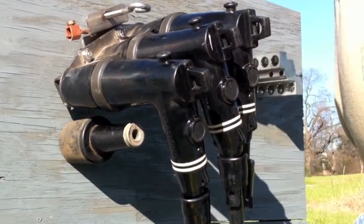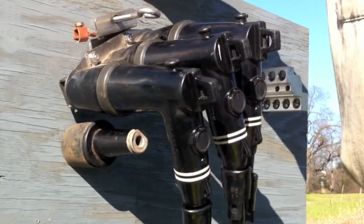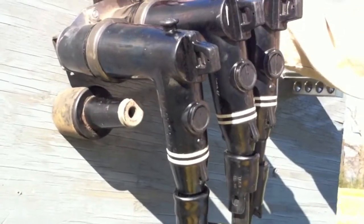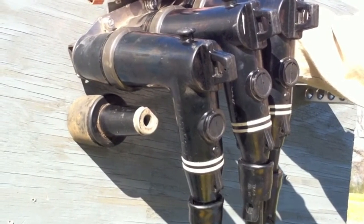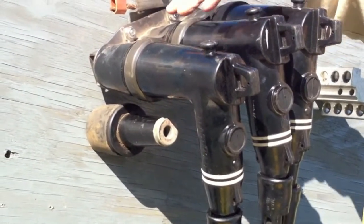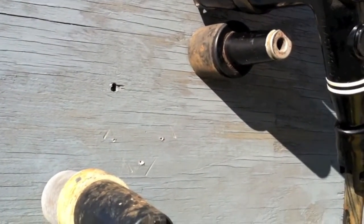All right, here we're demonstrating just a regular single phase pad mount transformer, feed in, feed out. What we're doing here is we're feeding through the adjustable junction, and it's an external feed. We're not going directly through the transformer. You'll feed in here, feed out here, and then pigtail over, and you only need to buy single bushing transformers with this device.